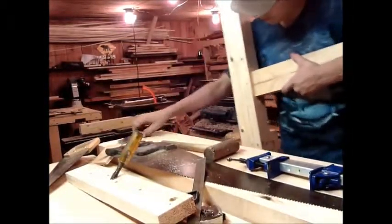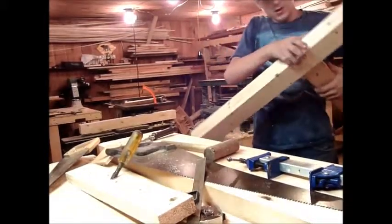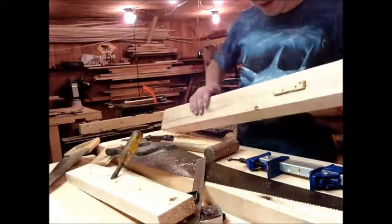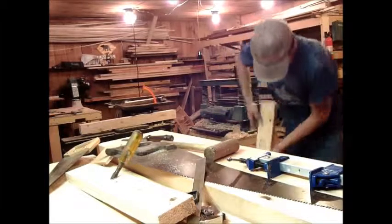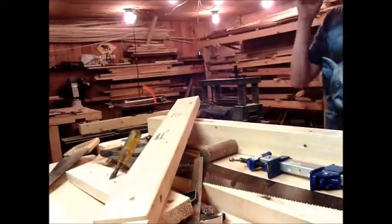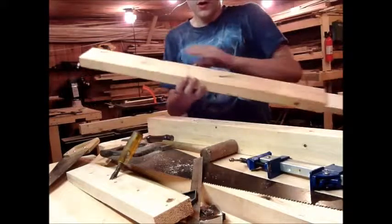So it fit. I got a nice clean shoulder line on there, except for a little bit of a deviation right in there. And the tenon is coming out about this far. So what I'm going to do is take a hand plane and put a chamfer on all the edges, then take a file and just round it over — give a nice smooth round. It's a nice tight fit. One side sawed clean so I didn't have to do much; the other side I had to take my chisel and really smooth it out, but it works.